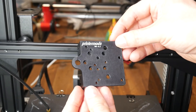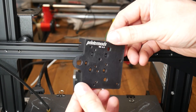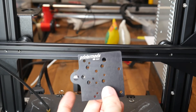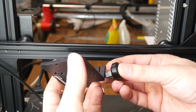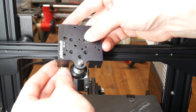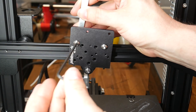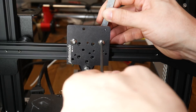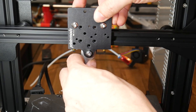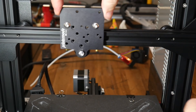We can now admire our new carriage including all of the different holes for mounting various extruders and hot ends. Yes, there are free printable versions on Thingiverse, but this is well made, strong, and good looking too. Start reassembly by putting in the lower roller, reattach the two belts on the underside of the carriage, then reinsert and assemble the bolts holding the v-rollers for the top. It's important to check for wobble and use a spanner to adjust the eccentric nut underneath if necessary.